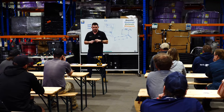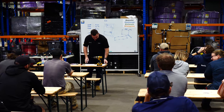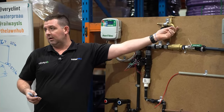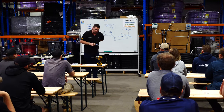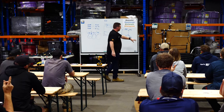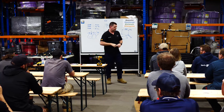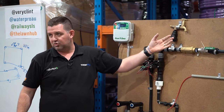From a control standpoint, we're looking at either manually or automatically controlling a system - those are ultimately the two options. A lot of people will run off a tap to keep costs down. You can put a fitting straight off a tap, run your system fine. Obviously it relies on the tenant not forgetting to turn it on. The most basic manual systems sometimes use a manifold with ball valves in the ground that you just turn on and off.